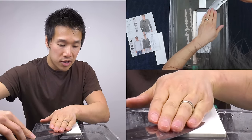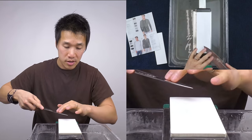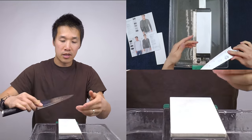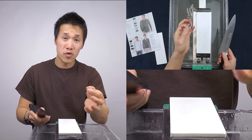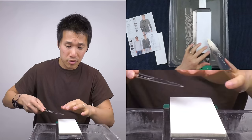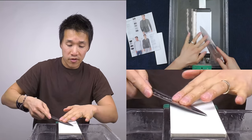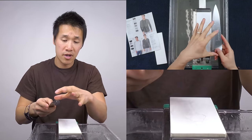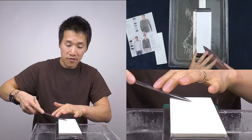If you're seeing hazy lines, that's not a big deal — that's just excess material still coming off. What you're looking for are really sharp lines. If you do this right and wash your stone carefully, you'll see micro pieces that look like mini pieces of lead the width of your hair — imagine cutting really short pieces of hair on the stone. You'll see little pieces of metal flakes, sometimes in a very short string maybe a quarter of a millimeter long. That is the burr coming off the knife onto the stone, and that's what you want to see — your stropping is pulling off all the excess material.